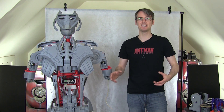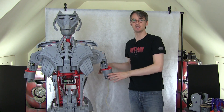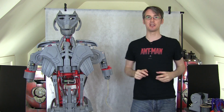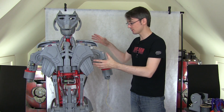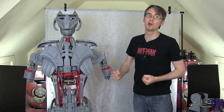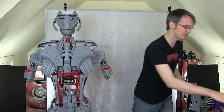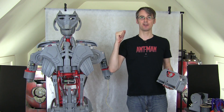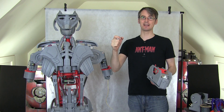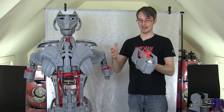In the other joints, I've got force feedback built into the mechanics. Each output is basically split in two, with a flexible rubber element and some force sensitive resistors that can measure force in each direction. It can work out how much load is on all of these joints — the shoulder and everywhere else — and also work out if you're pushing it back. Depending on its mood, defined by its AI, it may or may not comply, or it might push you back. We need to do the same thing with all three axes of joints here. For the elbow, we're going to put a string to pull it up so we can measure the string tension — if you pull it one way it gets tighter, the other way it gets looser.